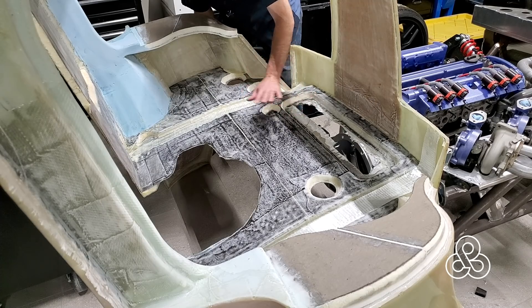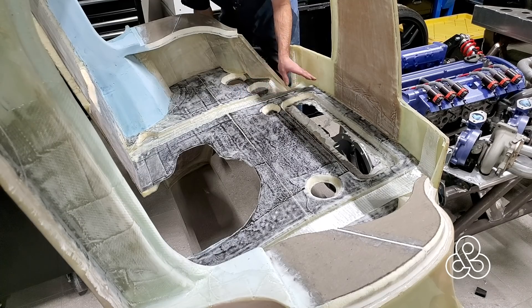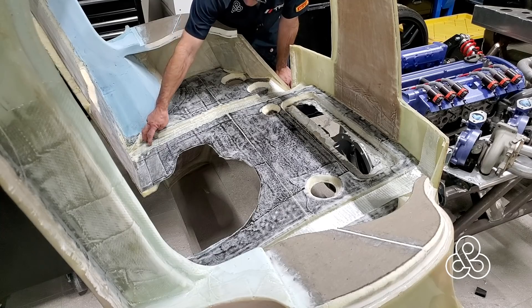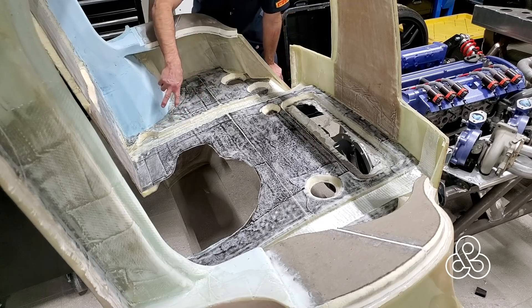These vertical laminate structures will always have enough strength to protect the occupant or hold the vehicle, but they are tied to the whole bulkhead which may be the weak point. To tie them all together, the roll structure will have tabs with bolts that travel through this structure and tie into our subframe and up to our upper braces. Those bolt-throughs go through to that upper brace, and down here there'll be bolts going through into the bottom part of the subframe, tying it all into this structure.